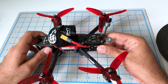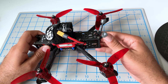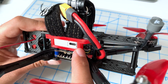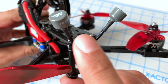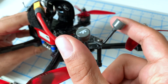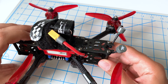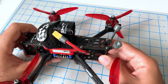What we decided to do was get the quad back together so we can at least see how the new antenna positioning performs. The antenna is connected directly into the air unit, soldered in, and zip-tied in an optimal V-shape. Because this antenna uses RG405 cable, which is very rigid, it actually holds the shape fairly well. We'll try this out, and once we get the custom-length antenna from TrueRC, we'll create a part two where we'll really see Franken DC5 come to life.